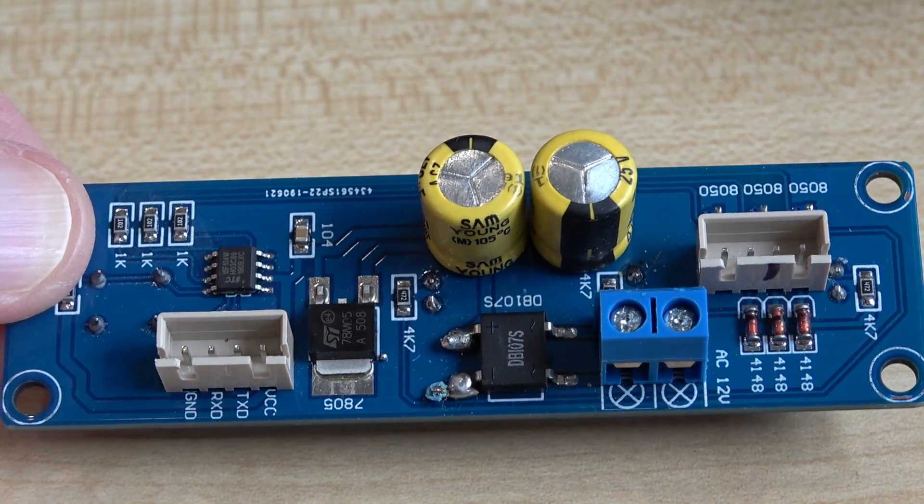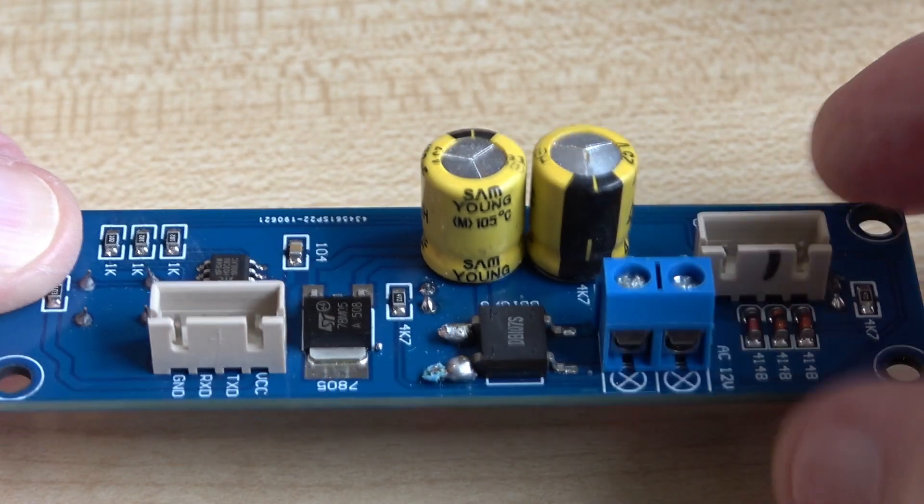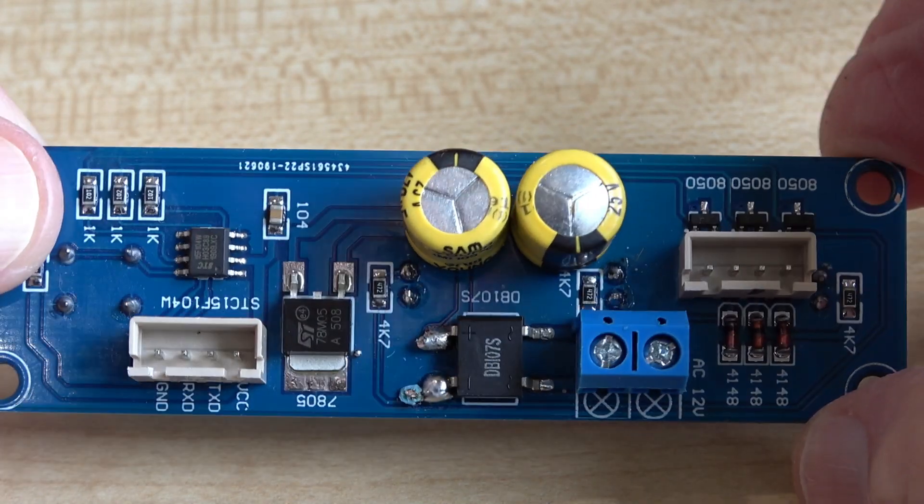I've gone on and sold two of them, and two I still have here. On the one I've been using — which contains my L12 amplifiers — I noticed the switching has been sluggish lately and doesn't cycle the way it used to. So I decided to look inside, and I found the fault on this board. If you look carefully, you'll see that this electrolytic capacitor is swollen.